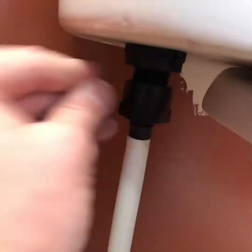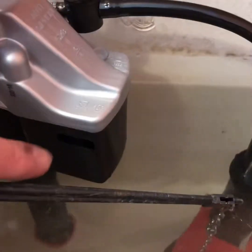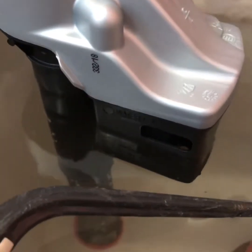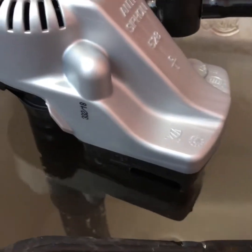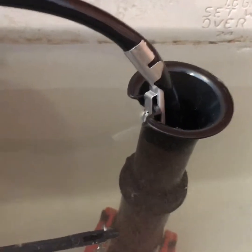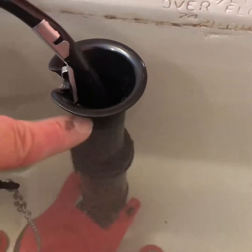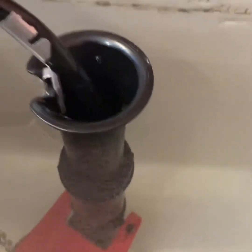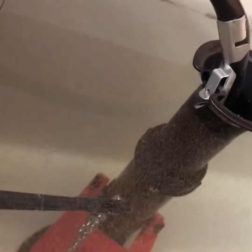The next thing we have to do is charge the water line and this reservoir will fill. Water's back on — check for leaks: nice and dry, nice and dry, nice and dry. Water's showing up; it should stop when it reaches right about here. That's where the water line is but that's dangerously close to leaking down here, so I'm going to go in here and undo that and raise this a little bit. On second thought, I'm going to let that go — I think that is a good balance, it is not leaking, and I think that's good. No leaks.